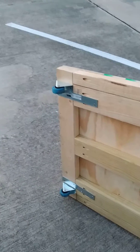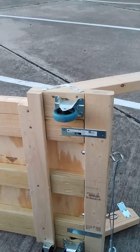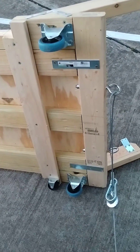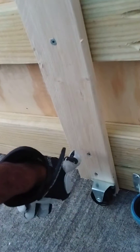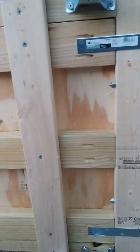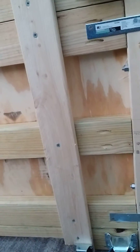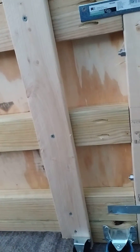Initially I had small wheels at the front and back but the small wheels weren't strong enough to carry the weight, so I used larger wheels here. I also added this 3x1 piece of wood here for additional bracing. I used pocket holes to attach these 2x4s, but you could design this differently — I had a Kreg jig at home so that's why I did it.